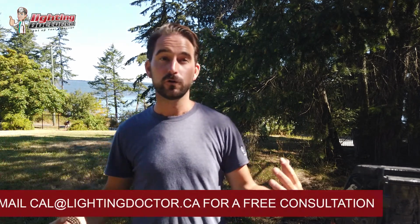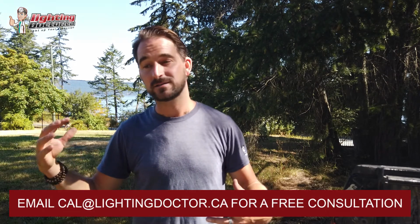So for all of those that kind of call in and ask, you know, what about voltage drop and all that, a general rule of thumb, you can easily run 100 watts of lights on a 300 foot spool of 12-2 cable with a 15 volt transformer and not run into any voltage drop issues. And if you have more lights or more wire than that, you need to just run multiple wires from your transformer and you'll be safe. And that's what we did on this project, and we had no issues whatsoever with voltage drop.